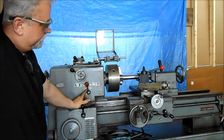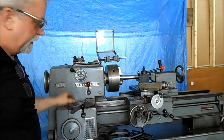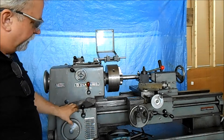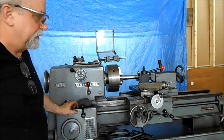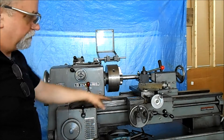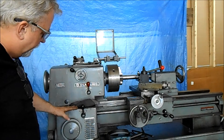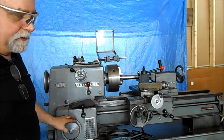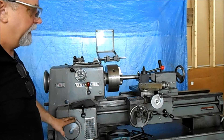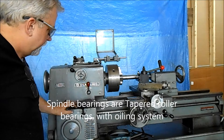It's in great shape. It's been gone through — most of it's been gone through. I've checked all the outboard gears. This part of the quick change system is all in an oil bath, and the headstock has an oil bath. The apron has an oil bath. So it's actually got three separate oiling systems. This is really nice because being enclosed in an oil bath keeps the oil in and keeps the swarf out of the gears and the quick change.